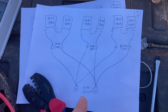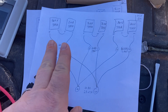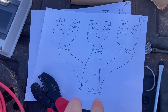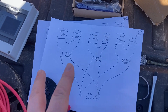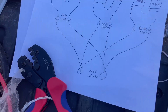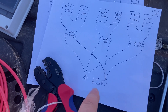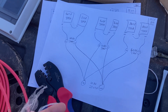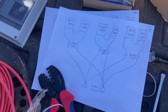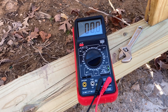After some deliberating, I'm back to doing two in a series and then paralleling the series together. I will need those connectors that go from three to one for each one of these. I've got 10 gauge wire which should be able to handle that amperage, and then 60.8 volts should be well under the limit even with voltage increasing on cold days. So this is with two in series and that's outputting 68.7 volts now.